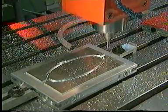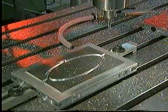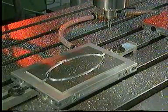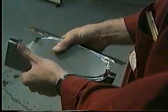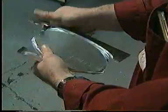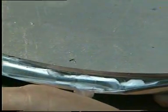But the real problem occurs when the component needs to be profiled and machined right through. The vacuum is immediately lost. To overcome this, the somewhat dangerous breakout technique is used. To maintain vacuum, a thin section of material is left at the bottom of the cut, requiring the piece to be broken out, deburred and finished by hand.